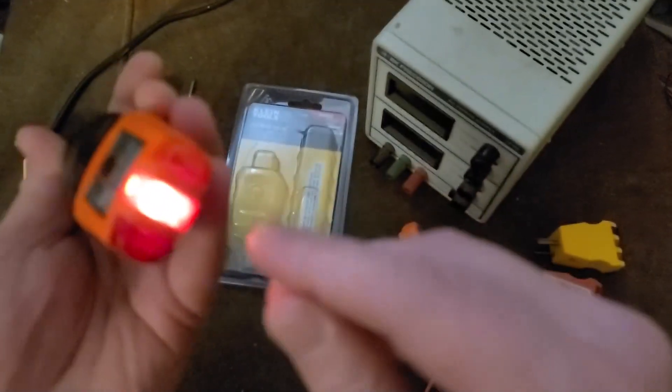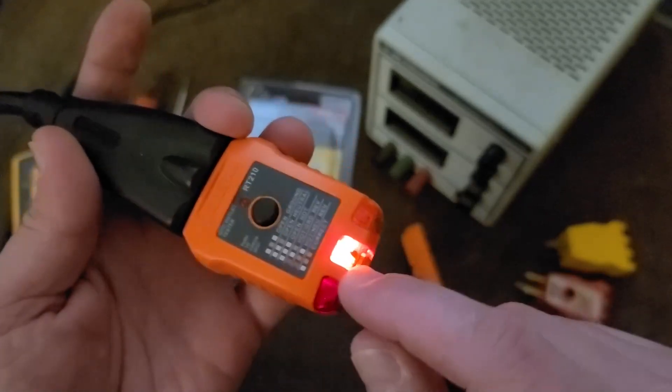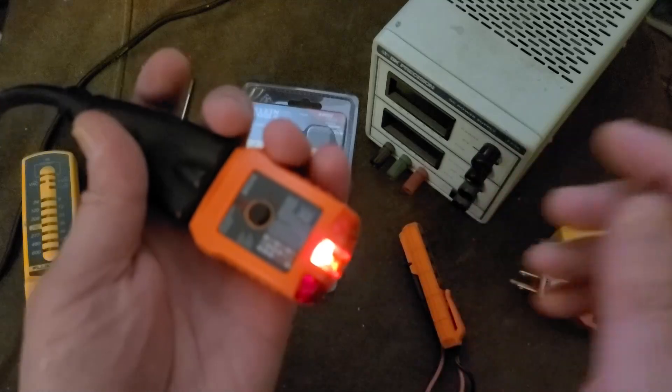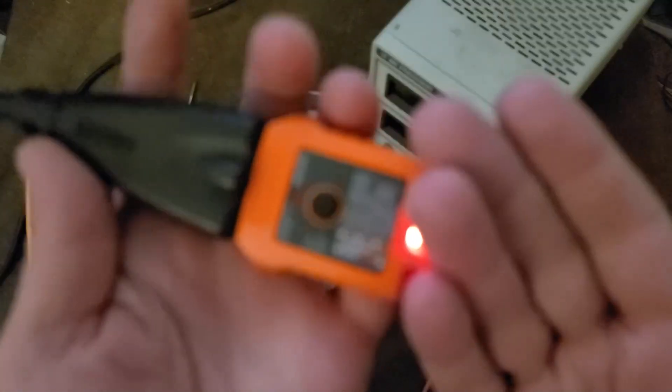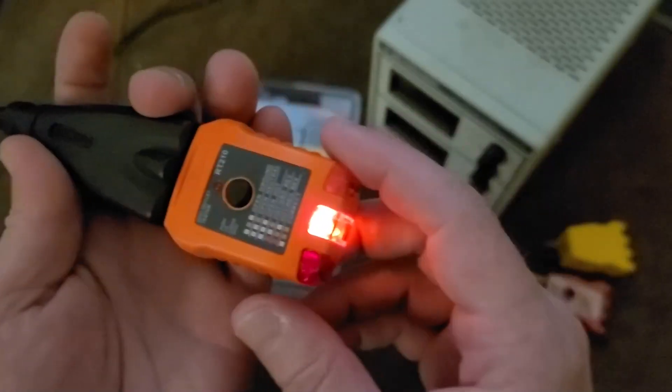Plug this in and it works properly. This cord is plugged into an isolation transformer so the ground neutral is broken, allowing the isolation transformer to actually do its isolating — and you'll only have one light.